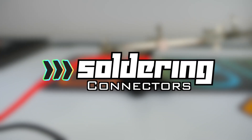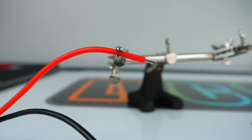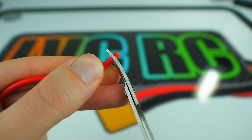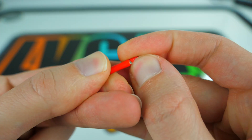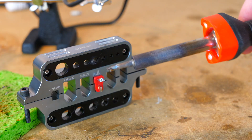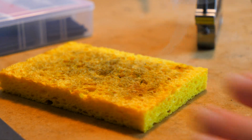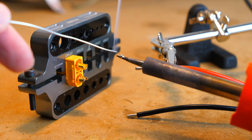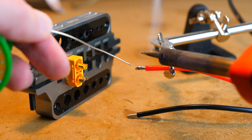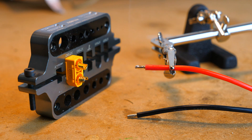Diving right into the soldering process, you'll want to make sure that the tip of your wire is either parallel to your work surface or slightly pointed down towards it. This will prevent solder from running further into the wire and stiffening up the end. Start by stripping the insulation off the end of the wire. There are wire stripping tools, but I typically just use Lexan scissors and lightly cut the outside. Now we need to pre-tin our wire — this is basically adding solder to both items before soldering them together. Before and after you use your soldering iron, always wipe it off with your wet sponge. Then take some solder and feed it onto the tip of your iron, touch the tip to the wire, and start feeding solder into the iron. As the wire heats up and the solder soaks in, you can eventually start feeding solder directly into the wire. I usually like to add as much as I possibly can.